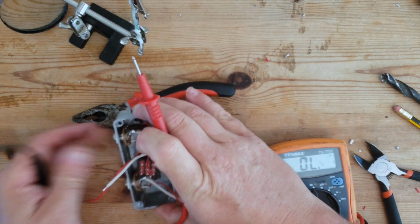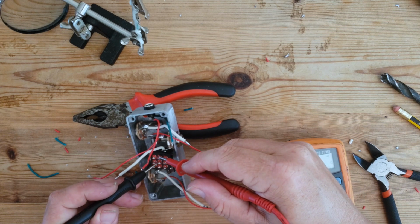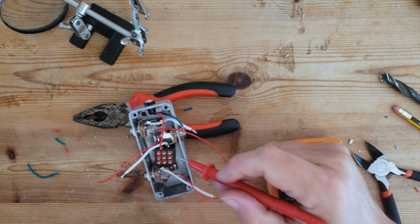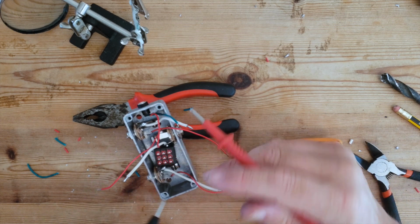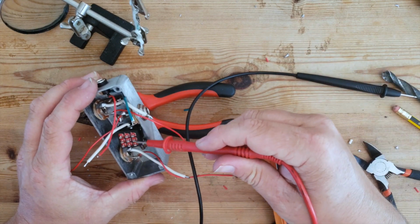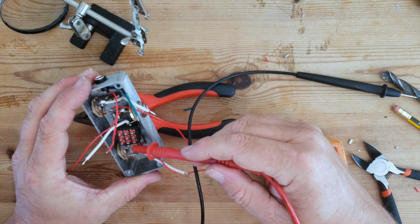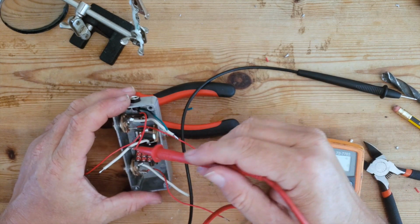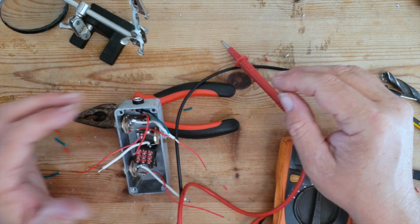If we click the switch, it will then reverse the circuit from there and open circuit from here, and it will do that on all 3 lines of it. So what we're going to use one side for is switching the signal, and then we're going to use the other side purely to power the LEDs, and the reason for doing this is we don't get any DC noise going onto the signal path.